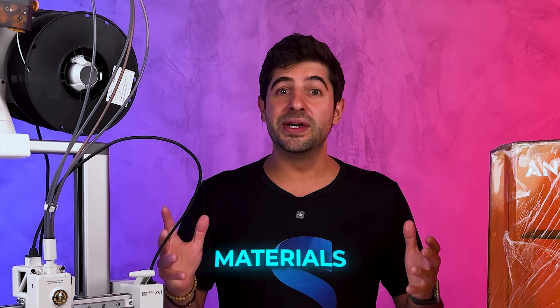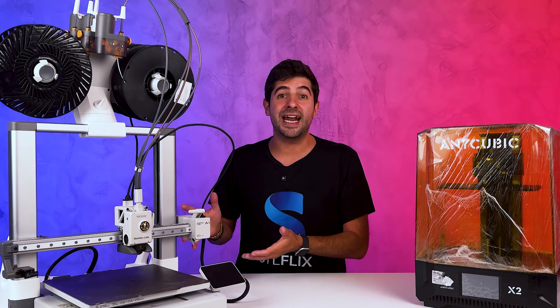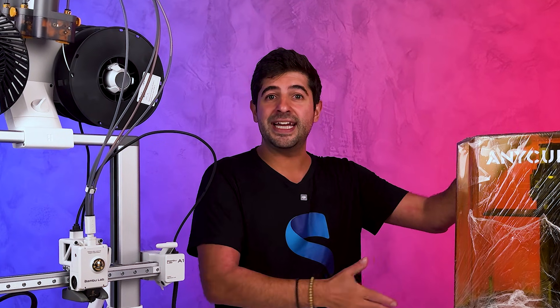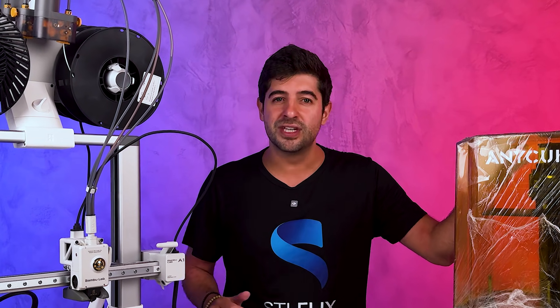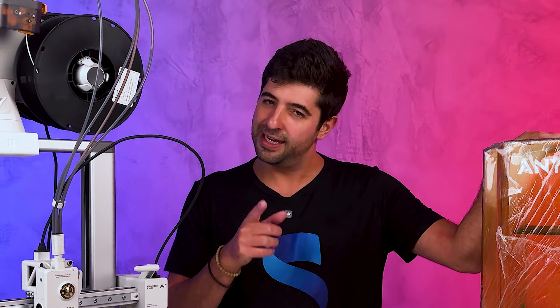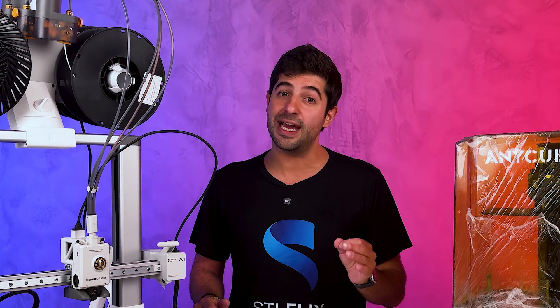Round 2 — materials and applications. In this round it's all about strategy. FDM, the versatile fighter, brings an arsenal of tools: PLA for quick moves, ABS for durability, and TPU for flexibility. FDM printers shine in creating large objects, mechanical parts, and functional prototypes. Resin, on the other hand, is the specialist — landing precise, game-changing hits in dental work, jewelry, and miniatures. Its materials include standard resin, flexible resins, and even castable options for jewelry making. So FDM is the all-rounder, while resin is the sniper. Drop a comment below and I'll help you decide if your next project is for FDM or resin.